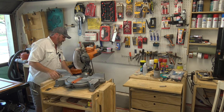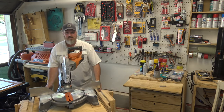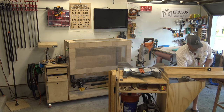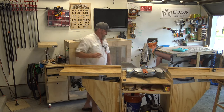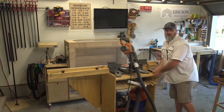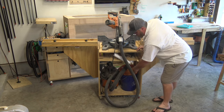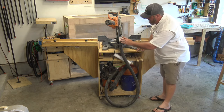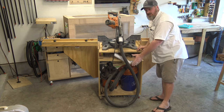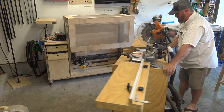The chop saw has its own on its stand. This is from the Fix This Build That guy's channel — it's a wing-out miter saw station. On the back for dust collection, I have the same setup: a Rigid shop vac, a cyclone dust collector, dust deputy, and a bucket. It goes up to a plumbing coupling — not a 45, it's a 22 and a half degree angle — so it still gets a little bit of suction out of it. It has the same relays on it and it works pretty good.